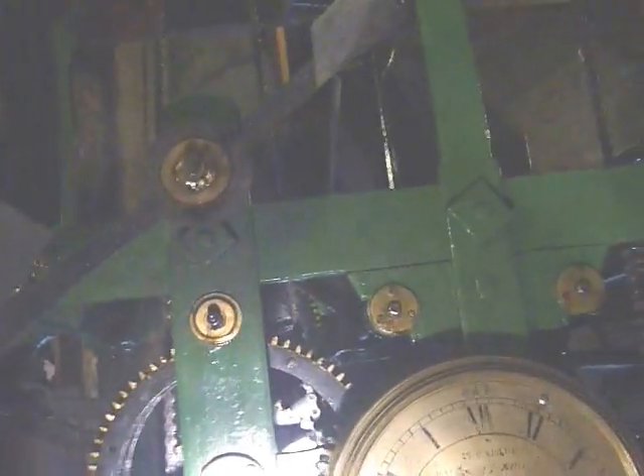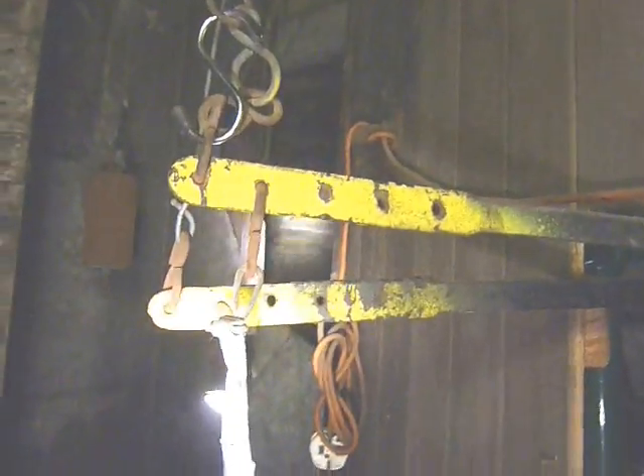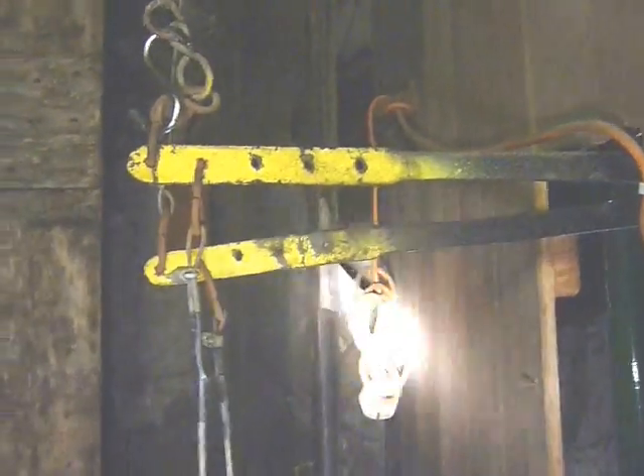That's called a fly, and that goes off when the bells go off. I think it sort of slows it down so it bangs nicely. There are levers off to where the bells go — two levers here for the ting-tang or ding-dong. I'm having problems with one of them, because one of them tangs and the other one doesn't ding. So I've made it a bit shorter with that strange little hook there — hopefully as an experiment that will make it go properly.